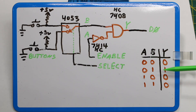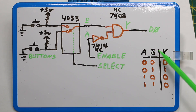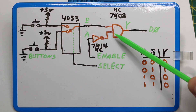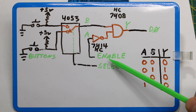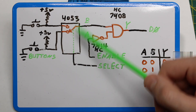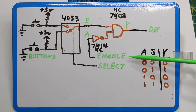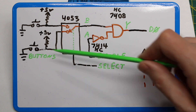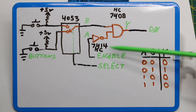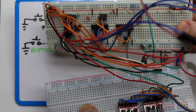Looking at the truth table: when enable is high — input A — we want the output Y forced to zero. A high on the inverter gives a low going into one AND gate input, so as long as enable is high, the AND gate output is always low. When enable is low, this circuit functions normally and passes through whichever button is selected. Basically, the enable control on this logic circuit either passes the high or low controller data to the TurboGrafx data pin, or disables it and forces it low. I've built that circuit with those three chips and have my 8-pin DIN connector ready to plug into TurboGrafx.